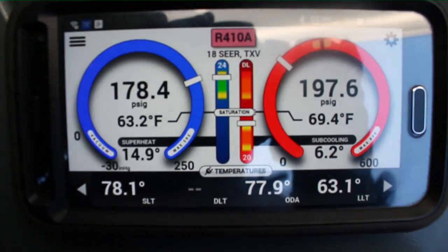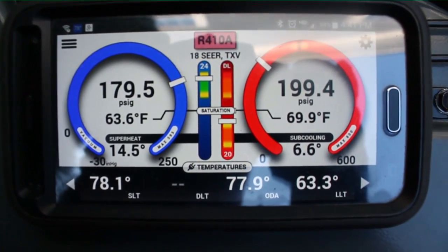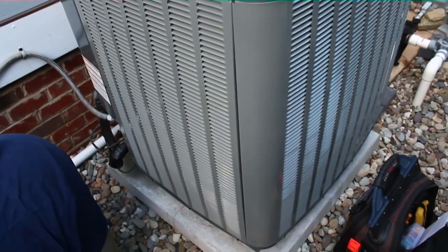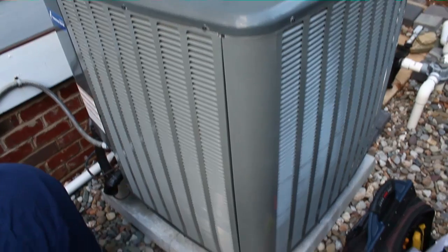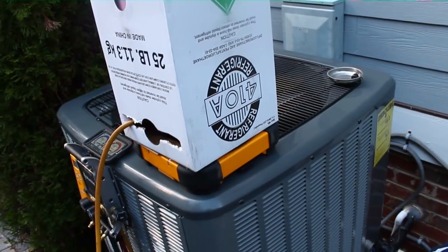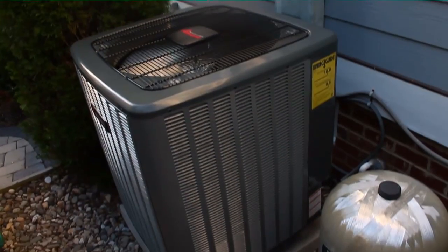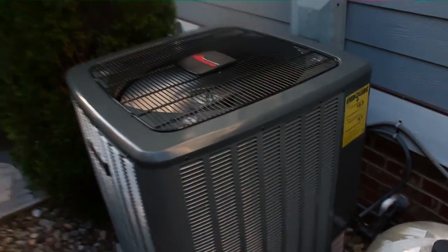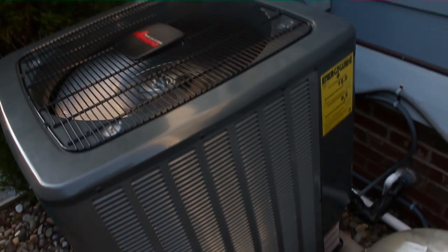Here we are putting refrigerant into the machine. On the right, I'm putting liquid refrigerant into the liquid line. On the left, you can see the pressure building up on the other side of the system. Here's our other unit running — they're pretty quiet units. Second stage is a little bit louder than first stage, but pretty quiet both ways. Still weighing in refrigerant — takes most of my jug. There's our three tons for upstairs. Here is our 18 SEER four-ton Amana up and running, happy again, fully charged — 18 pounds, 8 ounces of R-410A.